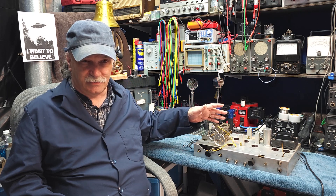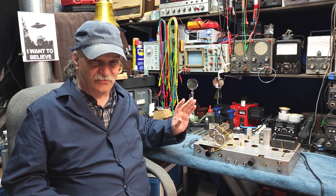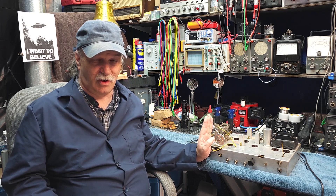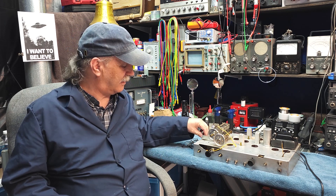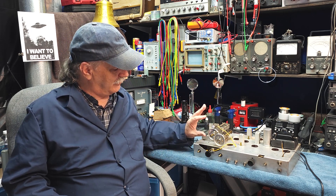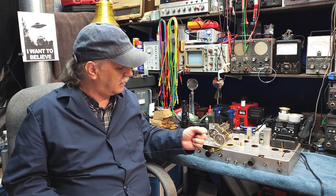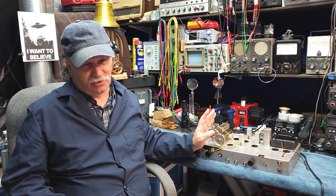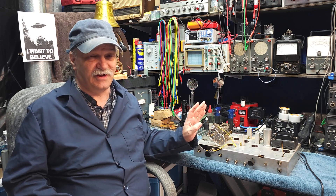This is going to involve just temporarily putting the face panel back on, because this capacitor can move side to side and we want to make sure the dial is in the center of the dial window. When we lock it down, we want the dial smack in the center. By locking it down without the rubber — as I've described, this rubber that Hallicrafters originally put in heats up, distorts, degrades — the capacitor begins to get pulled over towards the tuning tower because the tuning dial cords are pulling on it, taking the whole dial away from one side of the tuning window. Your dial calibration goes off. So we want to lock this down permanently so it doesn't move, so when we do a good alignment it stays and our dial calibration is accurate.